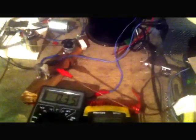But what's this? This is the second or third day of this cell's life with electrolyte on it. It's only Epsom salts, manganese oxide, which I've now run out. My jar's empty. I need to find some more batteries, wash the stuff. I soak it for about a week and then you can get the electrodes out easy. And then I scrape it out and I wash it.